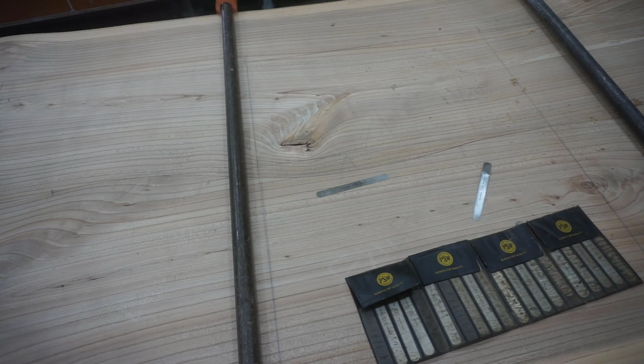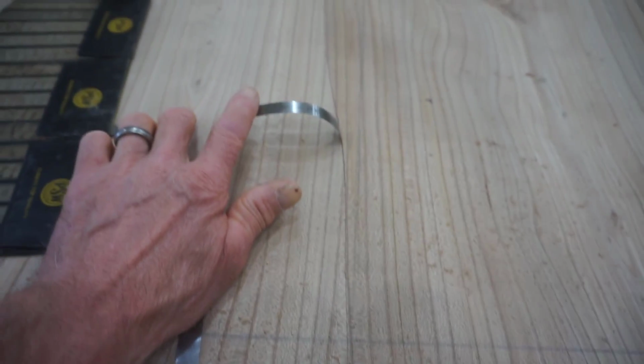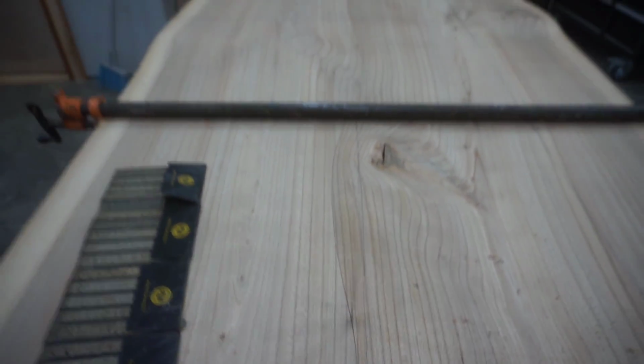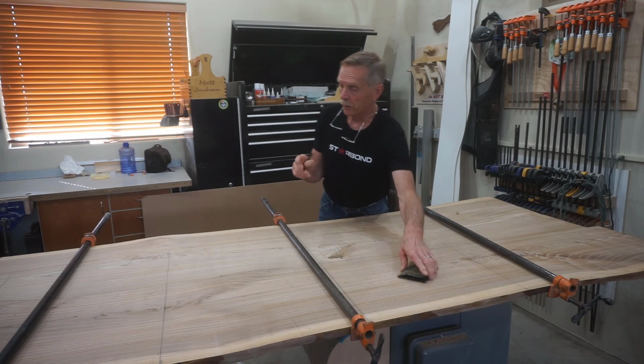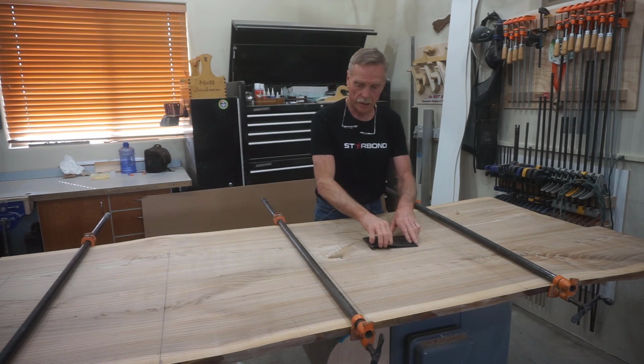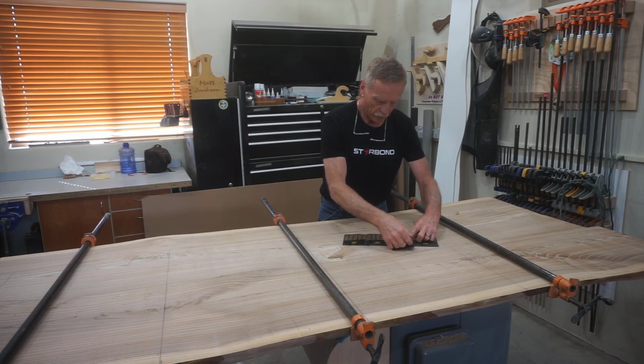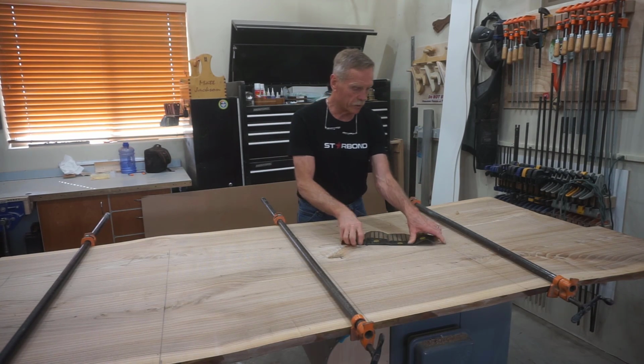I think I'm going to glue it. Because for the most part, other than this little bit at 6/1000ths of an inch, I think that's more than acceptable. Another thing about the gap that I do have here is that when I do this the final time, I'll add more clamps and more pressure to pull that together.